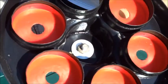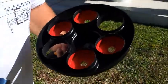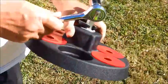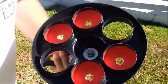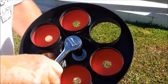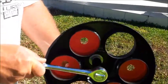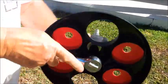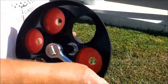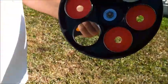Underneath you'll see the shaft and the nut. Now we've got the ball dispenser out — we look at the shaft on the top, put our wrench on here, and look underneath at the nut. I'm expecting this to be loose. Remember: to tighten it is anti-clockwise. To undo it is clockwise; to tighten it up is anti-clockwise. Get it good and tight.